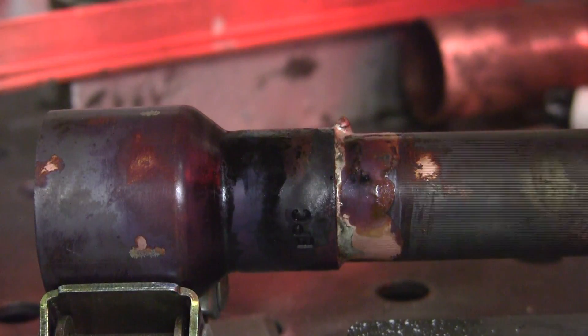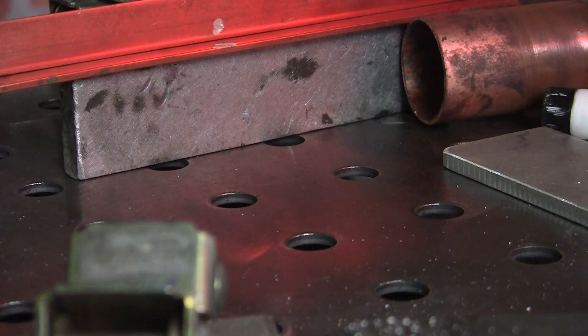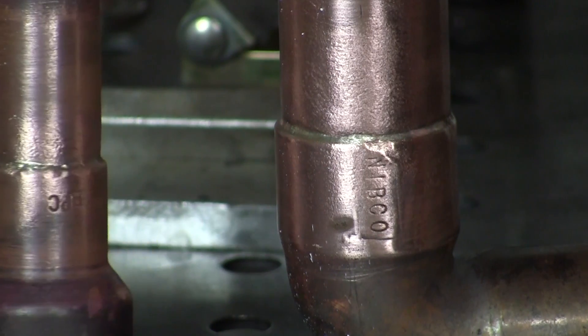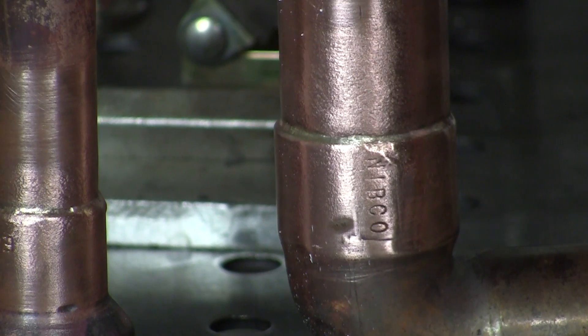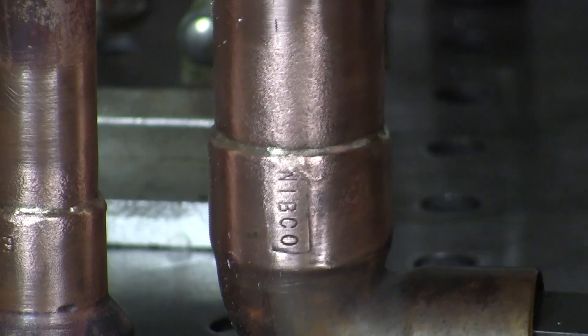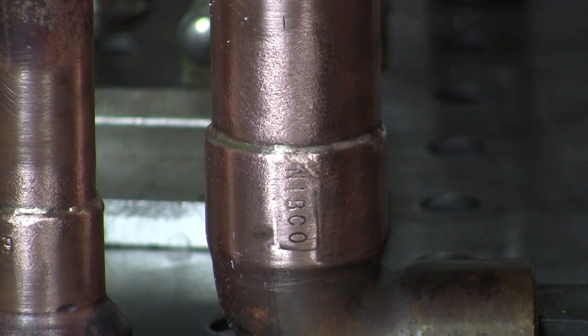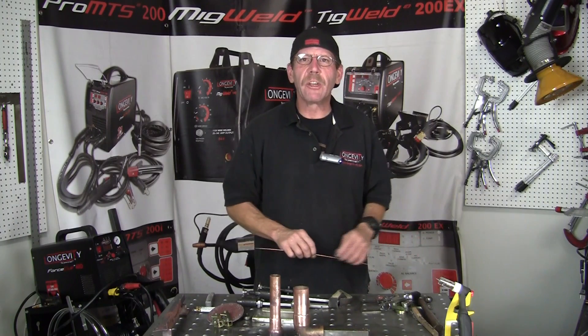Pretty easy. I haven't cleaned it off yet — I'll grab my pliers and dip it in some water. Here are our pipes with the silver solder, turned fairly even. This is after I've already wire-brushed and cleaned it. It'll be black like this after you're done, just like if you were using a regular torch. For TIG welding in a pinch, that worked out pretty good. With silver solder, you should know that you don't have to have oxygen-acetylene or propane — you can use your TIG welder. The Longevity 200SX seemed to work out pretty good. I'm Rob, thanks for joining me on Longevity Learning Lab, see you next time.